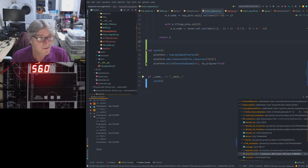So I do need to test that, obviously, whether I move it or whatever. I just need to test the basic functionality, which basically is just having a conversation with the power delivery chip from the STM32. It's basically I2C, which goes down to the mezzanine to the ILB anyhow. It doesn't matter whether it's on the mezzanine or on the ILB, the conversation is going to be the same.